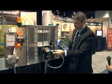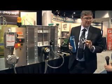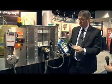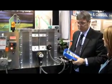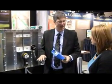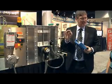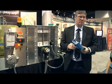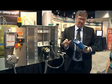This is an actual test from the front end of the speed switch all the way through the control system, so you can be absolutely 100% assured the system is functioning correctly. The old method of testing was just verifying that it would shut down. Now they can be absolutely sure that it will shut down at the exact point it's required to — at 20% below normal speed. Previously, they didn't actually know that. Now they do.